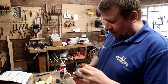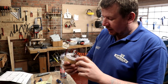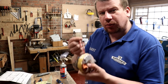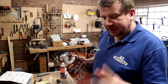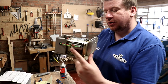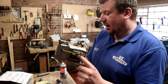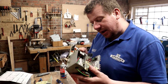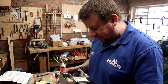I've done a little bit of research - it turns out these are called toroidal power supplies and you can get them in 12 and 24 volts. This one says it's 100 volt amps which is about 100 watts. I'm not very confident about putting another one of these back in, so instead I've ordered one of these - a normal encapsulated transformer. It's 100 volt amps and it's going to be 240 to 24 volts AC. We'll pop that in when it arrives and see if that actually sorts out our problem.